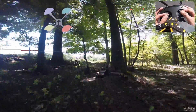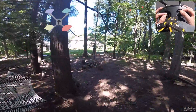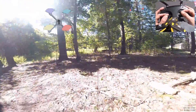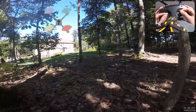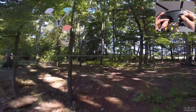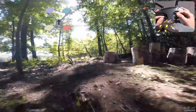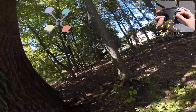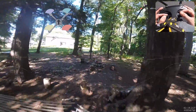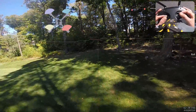I don't feel as connected with it because obviously I'm not. To each their own - it does definitely smooth stuff out a little bit, right here around the center stick, because I'm making micro adjustments. Like back there getting through that gap, I think it helped out smoothing that out. I'm using a bi-quad here, so I could change that to a PT1, and that would reduce the delay. I think right now it's saying I have like 40 milliseconds of delay, and that would change it down to like 30-some odd milliseconds.